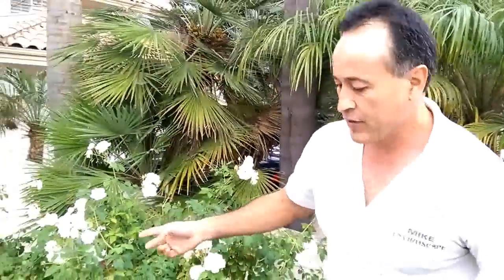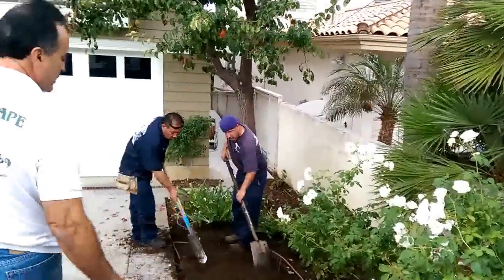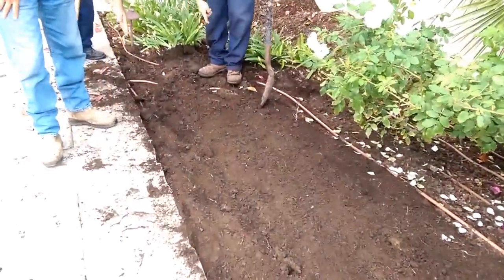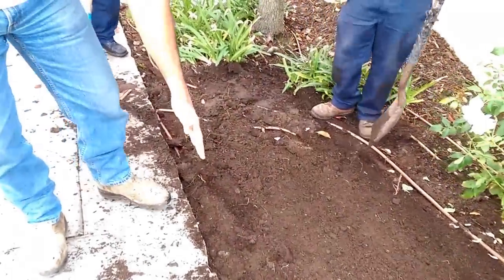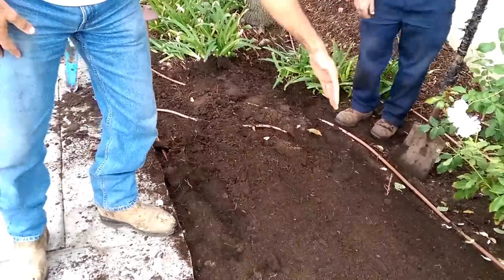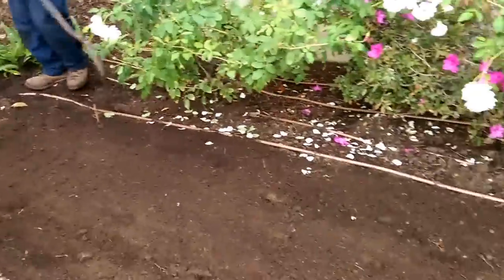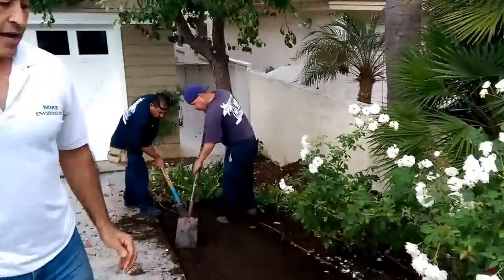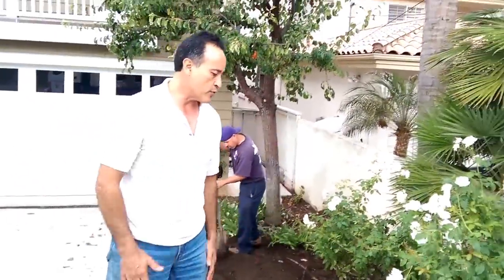The workers are just covering up the drip irrigation here — they laid lines every 12 inches, about 2 inches from the concrete, then every 12 inches across. We're going to lay grass on top of here. This is subsurface drip irrigation, and it's the way to do it.